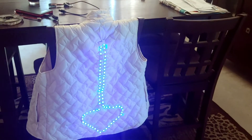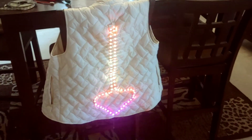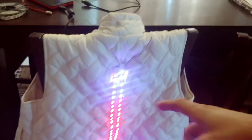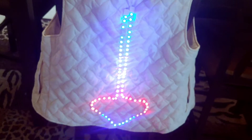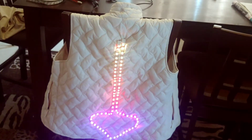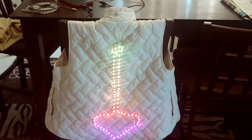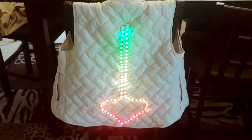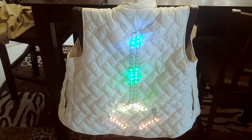It's nothing I would sell anybody, but just throwing something together that you can even work on out in the field is fine. What I've got are two of these strips, two separate strips going into the Arduino. This is probably the max — I think I've got just about 76 or maybe 80 lights on there, which is at the max current-wise for the draw on the Arduino because I've just got it going into the pins on the Arduino.